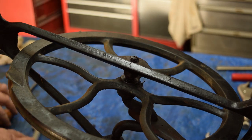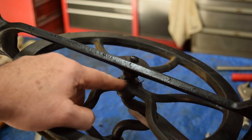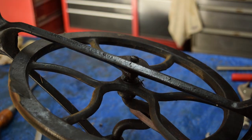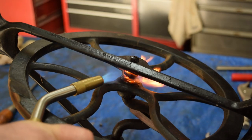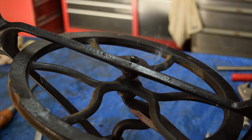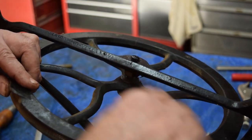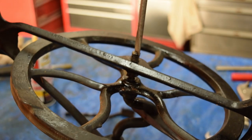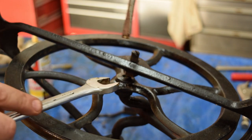Okay, that nut has to come down. And I don't know if you can see it, but there's all sorts of fabric and other detritus wrapped around those threads. So I'm going to clean them off. That ought to do it. I think we got to get that nut off completely in order to lift this up out of here.